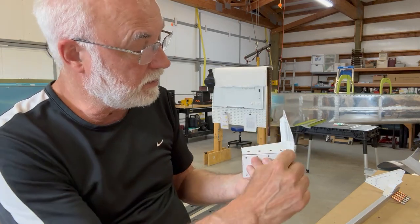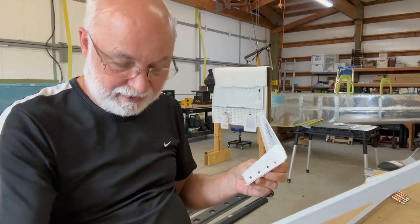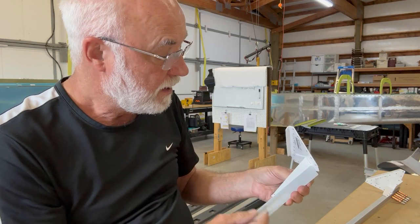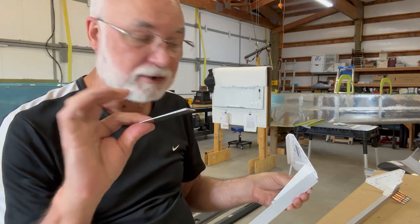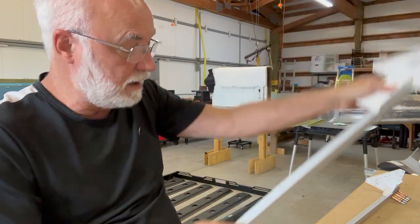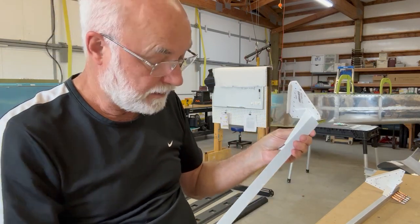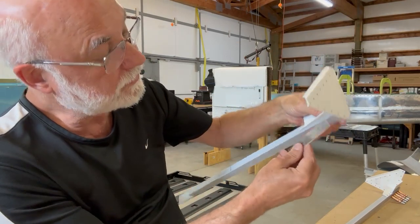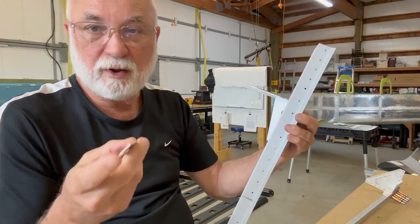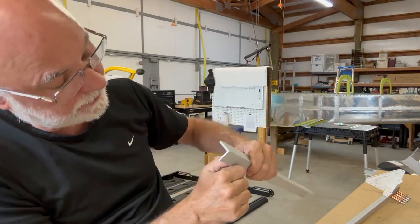And the reason the other one didn't do it is because there is no weld sticking up where the longeron is, but this one there was. And so I was kind of going to have to do it again. I'm going to have to make a whole new longeron and buy a new motor mount. But I came up with a better solution, and that was put a spacer in between the motor mount, which is designed to be flexible. So I think they know that these things don't line up perfectly. But with that gap there, I needed to put a spacer in there. So I just made this little spacer with a radius that will slip right up into the lower longeron and fit nice and tight there.